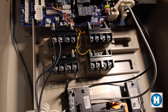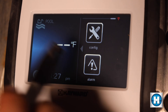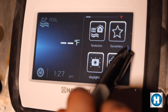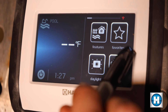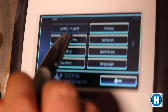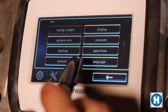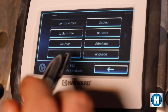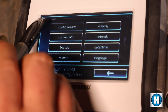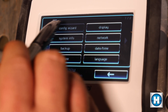Now we're going to show you how to program your freshly installed Hayward lights. You might have to tap the screen to wake it up. Then tap the arrow to the right and hit config. Go to the config wizard to type in your MSP — it's like the password to get into the configuration screen. If you don't know it, builders will often write this number on the Omni somewhere. If you can't find it, hit the system info button and you'll get it at the very top of the screen — it will say MSP ID and display a six-digit number.